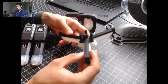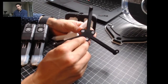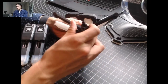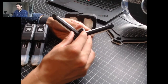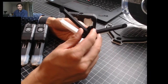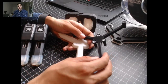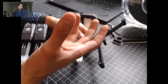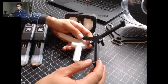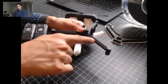Coming back to this part again, you can see how the insides of these pipes also have supports, right? I was able to remove this first layer or base layer of supports just by wiggling around, kind of cleanly. But any cavities, any internal supports, or internal cavities of the part that might require soluble supports, that's what happens inside of these pipes. So the inside of these legs are actually hollow, right?